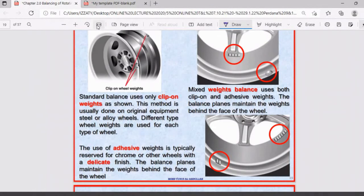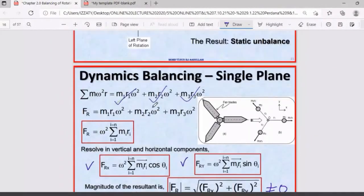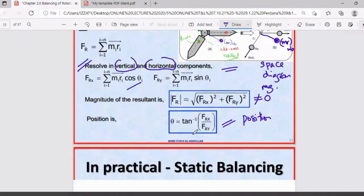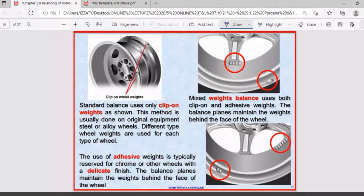As already mentioned earlier, when you find that it is not balanced, these are the things called balancers to put on the wheel, the alloy wheel. Either you put an adhesive to ensure that it will stick on without flying off when the car is running at higher speed, or it can be a clip, C-L-I-P, with clip. This one you put adhesive. It's basically the same thing, as long as the balance weight will not move or fly off when the wheel is rotating.